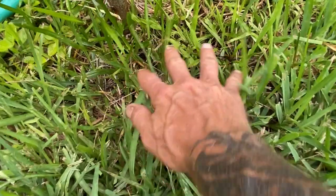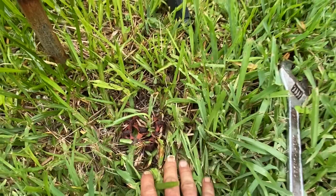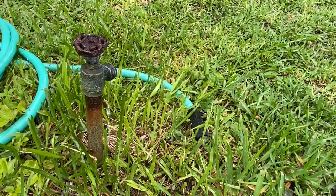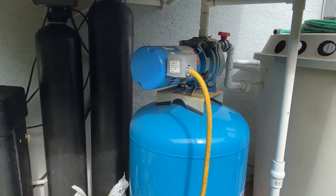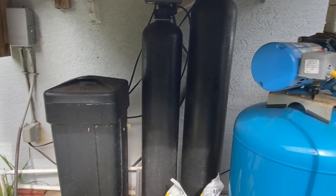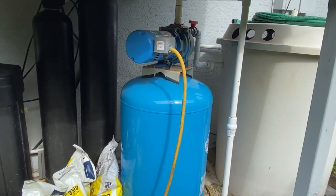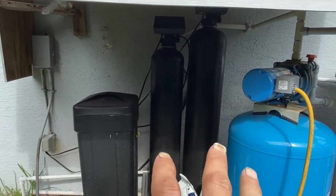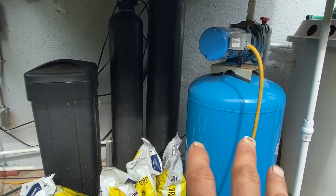Down here there's a water main shutoff — it's about a two-inch main for the artesian well. We're not trying to get into that main, we're just trying to change that spigot out. This whole house runs off a deep well artesian system. Now, artesian wells are very sulfuric, so you need a well treatment system completely or else it'll end up ruining your fixtures inside the house.